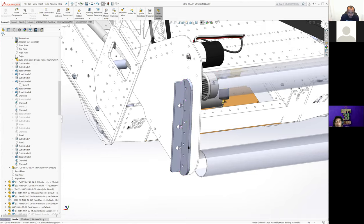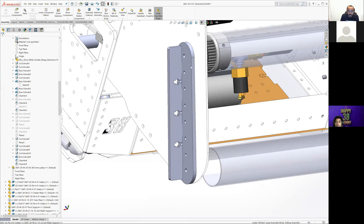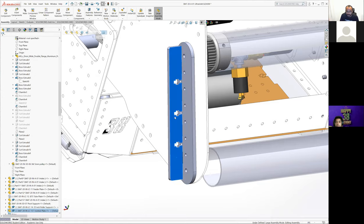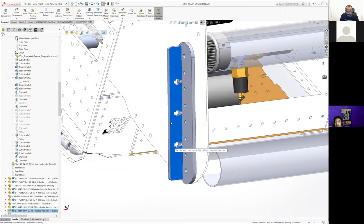So as we were looking through solutions, the one that we ended up getting ready to test was basically building the stiffener plate that was a piece of quarter inch polycarb, which will already help, right? Because this is going to be harder to bend than this piece of eighth inch, but you're still not getting the resistance in the axis you actually want. So by having this plate slotted into here to change these two bolt distances, instead of just having to bend these two plates, you actually have to bend this plate at a plane, which is much, much harder to do, right? Because you're bending across this full inch or so, and the Lexan just doesn't want to bend that way.